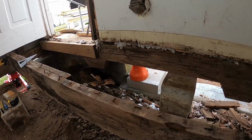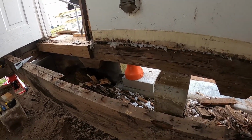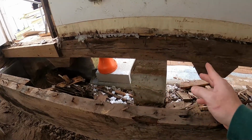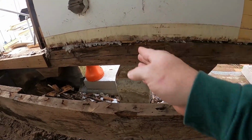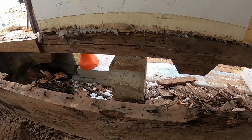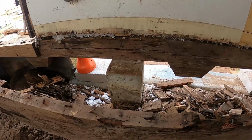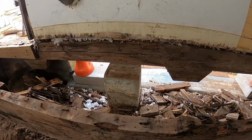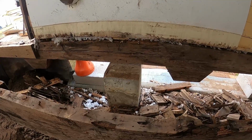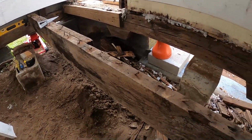That's a 4x6 beam. What I'm gonna do though, that's a 12.5 foot run. In this center piece here, I'll have the 2 bricks laying over, and I'll mark where those are and put the connection in line here. The center pieces of the 3-ply will lay even on the beam, and then the outside edges I'm gonna leave at 8 feet and tie those in where they go. So that's it. That's today's project. And if I have time, I'll start pulling out this old floor beam and putting in new ones.